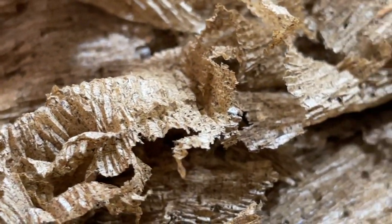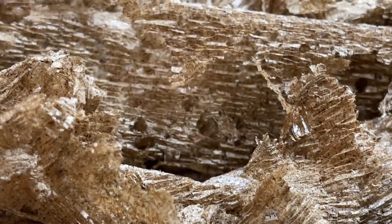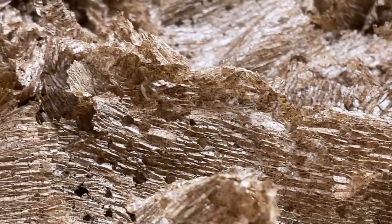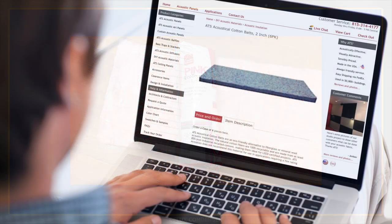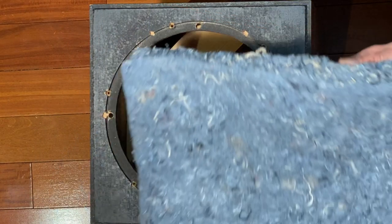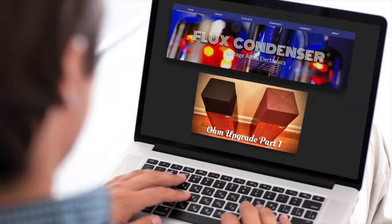Some of you suggested I keep the original Kimsul insulation, but that just wasn't practical as the old paper was deteriorating and just too fragile. Fiberglass would have made a suitable replacement, but I decided to ditch the itch and order some 2-inch thick cotton bats from ATS Acoustics. The stuff is eco-friendly and I believe made mostly from recycled denim. You may recall it's similar to what Ohm provided for the Walsh 2 upgrade I did. I'll leave a link to that series in the description if you want to see how that turned out.